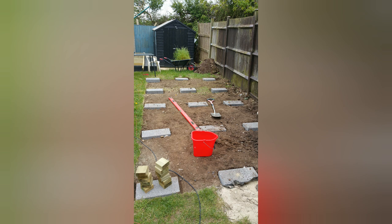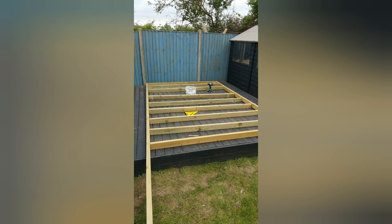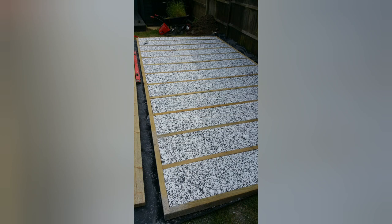For the base, I decided that five rows of three blocks would be sufficient. Once they were all level with one another width ways and length ways, I removed enough soil so that the blocks were above soil level, leaving a sufficient air gap. For the floor I went with 16-inch on center — the base is plenty strong enough. It was all put together using screws, then the 75mm insulation was pushed tightly between the cross members and the damp proof membrane was laid underneath the entire floor and wrapped around the sides.